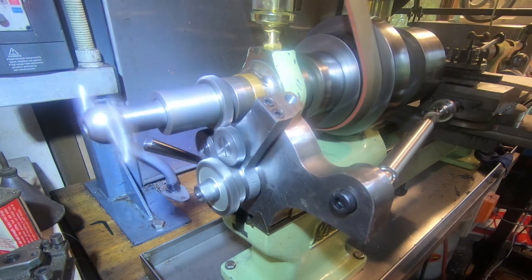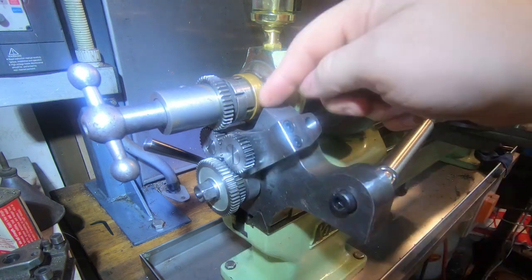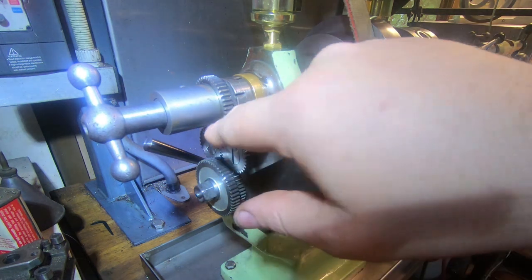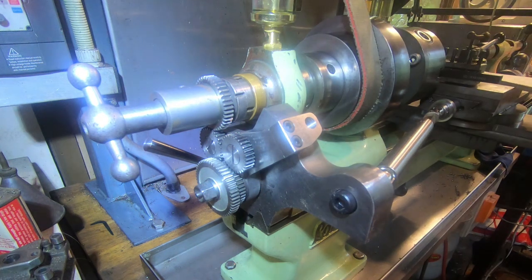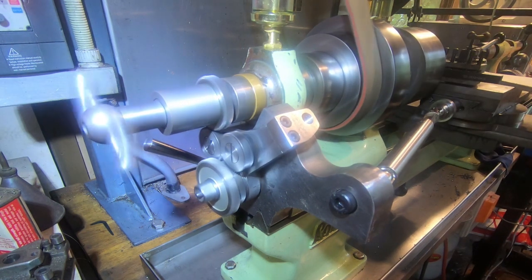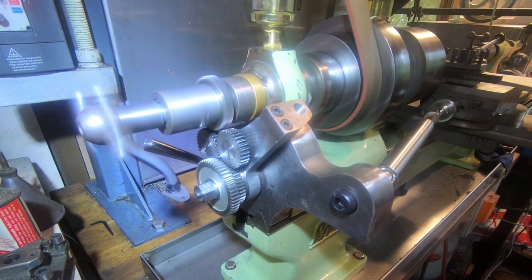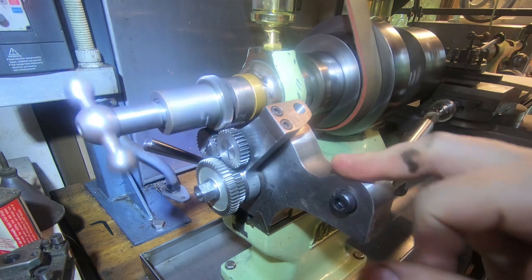And this tumbler system, which has 2 gears, when it's up in the top position, it runs through an intermediate. So this is just an idler. And when it's in the down position, it runs through just the one gear, so it runs in the opposite direction, like so. It's also got enough space in between for a neutral position, so that doesn't work at all, which is probably where it's going to spend most of its life. So I'll drill 3 holes and I'll put a plunger in here so that we can select the 3 gears. That'll be the next thing.